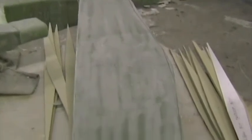On the top of the spar plank, you can see there the pencil line as per page CT1. This should ideally have been trimmed off before joining the two together, but I'm busy doing it now. In the center is the joystick pivot bolt, drilled beforehand and countersunk from the inside. And there is a pilot hole for where the wing pin will ultimately go, and the same on the other side. Those will increase to 40 millimeters a bit later on to put in the bushes.